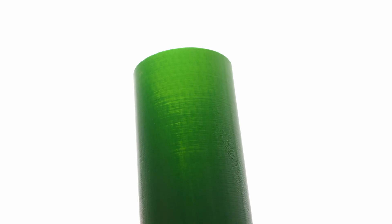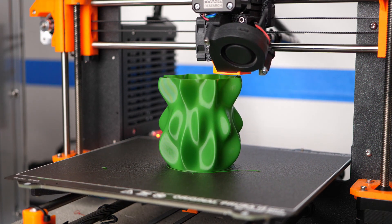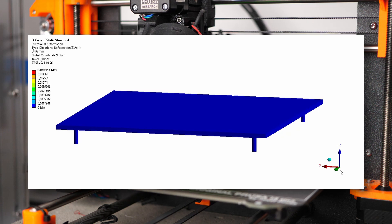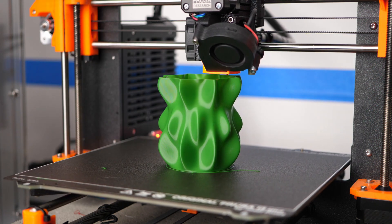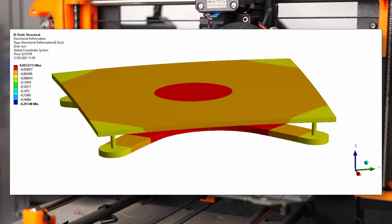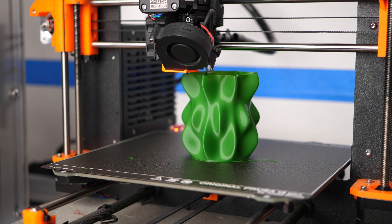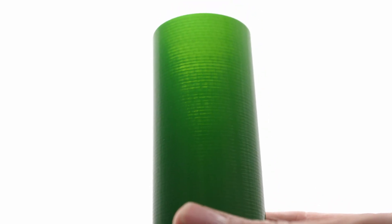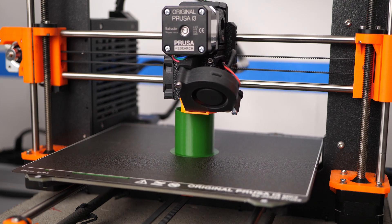Unfortunately, this temperature fluctuation was enough to cause the z-banding, because as soon as I switched back to PID control — though still noisy — everything looked perfect again. During these temperature variations, several things happen that cause the problem. First, thermal expansion: spacers and the bed will expand or shrink due to the temperature change, moving the bed up or down relative to the printhead. Second, also due to thermal expansion, the bed will get bigger or smaller in comparison to the cold carrier and therefore warp the whole assembly. All of that together causes the print platform to constantly deform during temperature changes, causing thinner and thicker layers visible as surface artifacts. This is why you should make sure that your bed temperature is as constant as possible, though depending on how your bed is built, this effect can be smaller or bigger.